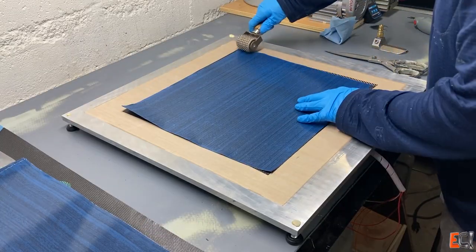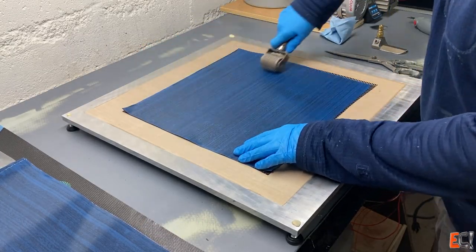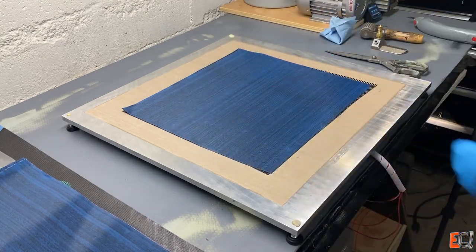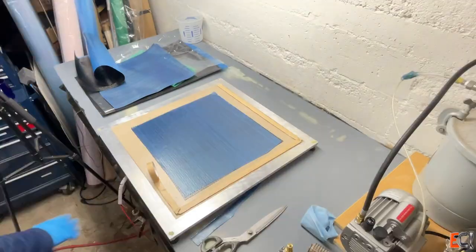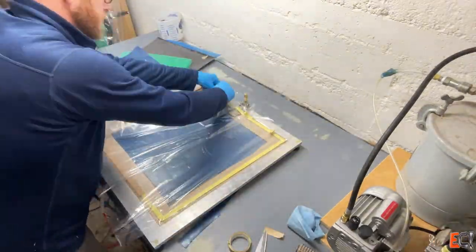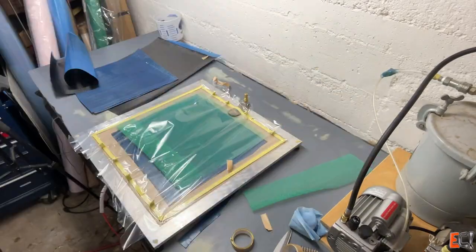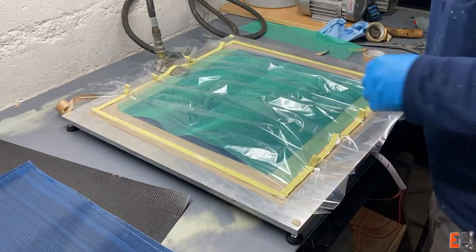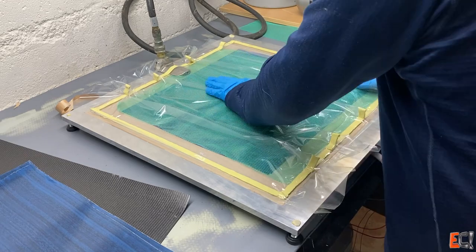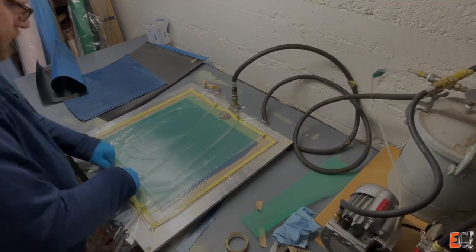And so now I've got these first two plies down, a 200 gram twill and a 300 gram uni, using a spiky roller to make little holes in the backer on that uni, and then doing a quick debulk bag here. And I'm putting pleats in it that will accommodate the ribs once those are there, just leaving room for those pieces of foam in the bag.